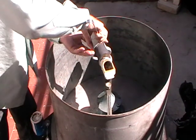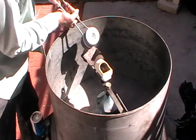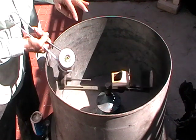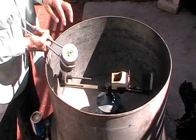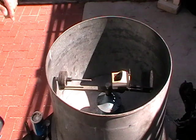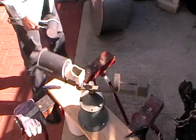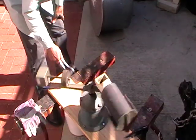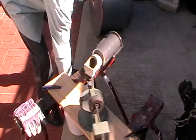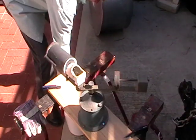Slide the crucible out of the way and grab the flask. You can see the metal in the button here. I always put more metal in than I need, because it doesn't really matter if we have more in the button — it just gives us more push against our pattern. We're waiting for the last flask to cool. Put the one that's cooled enough into the water, go straight to the bottom, swish it around, and you can feel it rumbling. When it quits rumbling, you can touch the metal with your hand.